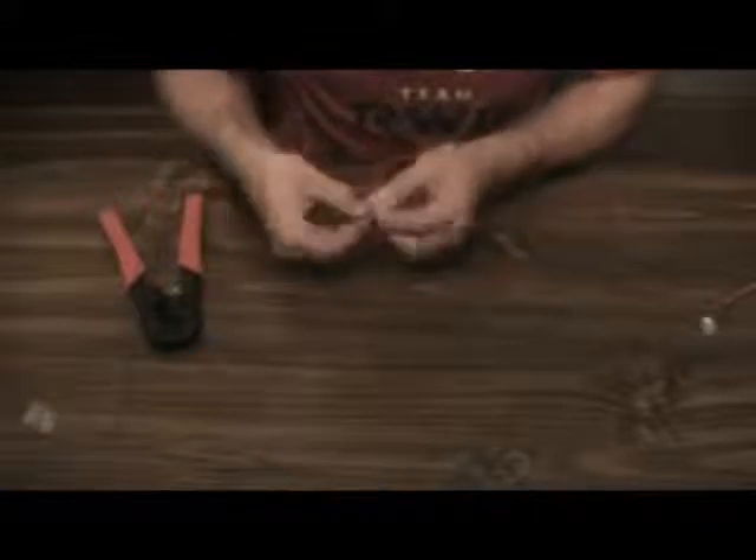I've got my Cat5 crimpers. One side has a blade, one side has two blades. Typically the two-blade side is where you cut the outer sheath. The single-blade side cuts the entire cable. I'm going to insert through the double-blade side a little bit past the actual crimper to get extra cable to work with. I'll apply light pressure to start cutting, do a little twist, and as you can see it cut that outer sheath off. Since this is shielded cable, I'll cut off the foil and the grounding wire inside.